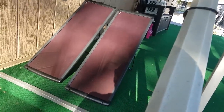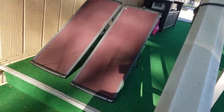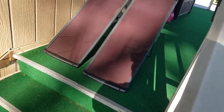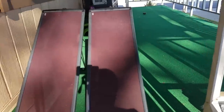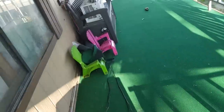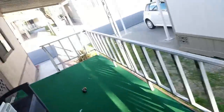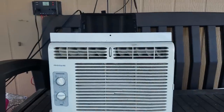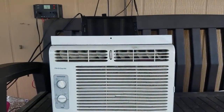I put up 50 more watts of solar. Not full sunlight, but they're still going to help because these Harbor Freight solar panels are actually pretty efficient — we're probably running at about 60% of their full capability. So we've got 200 watts of solar panels working right now.